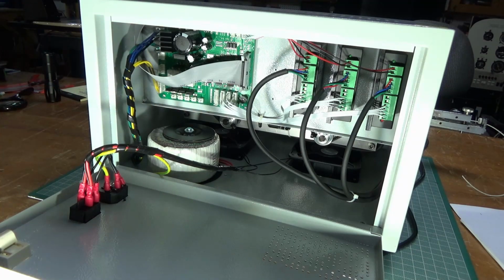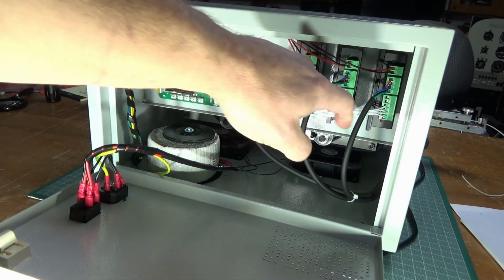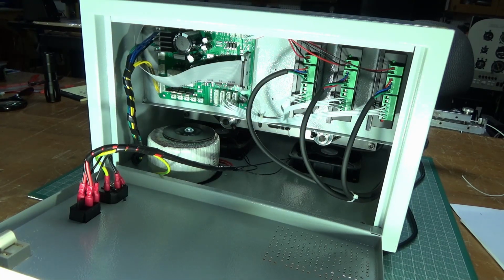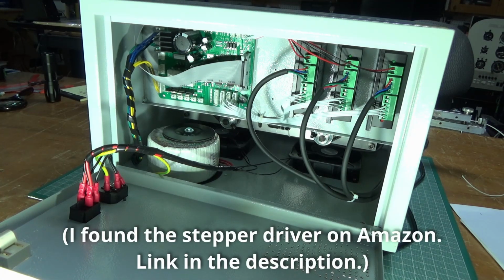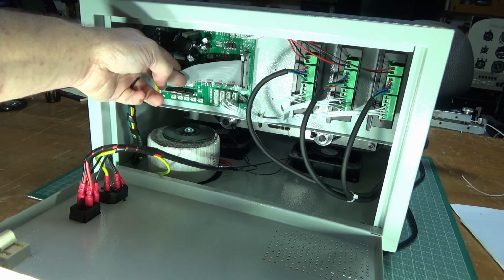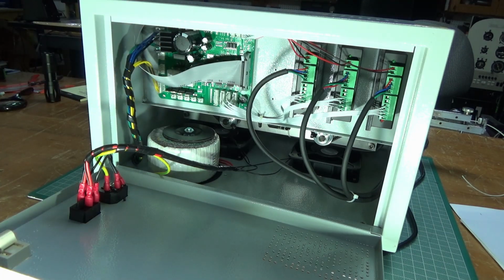The machine has got 3 stepper drivers, okay? And looking at them, the number on them is B1206. And it looks like a configurable stepper motor driver with dip switches for settings for stepping and things like that. I'm assuming this goes to the front panel.